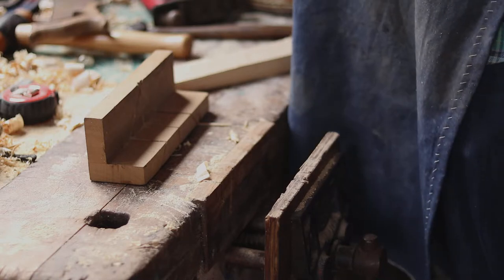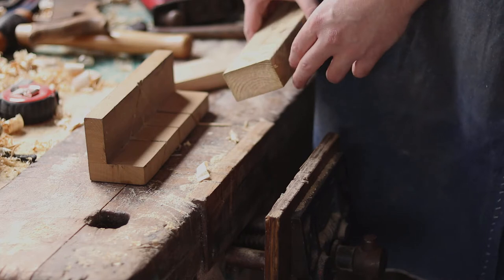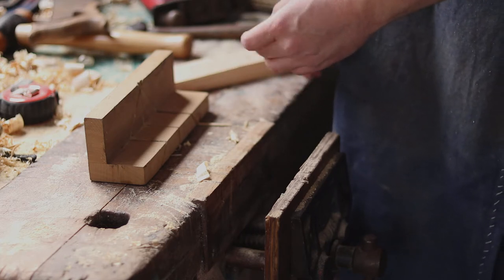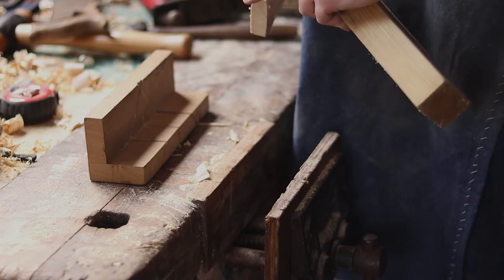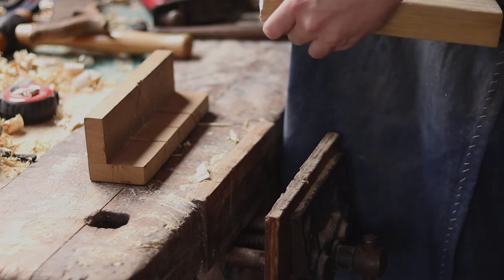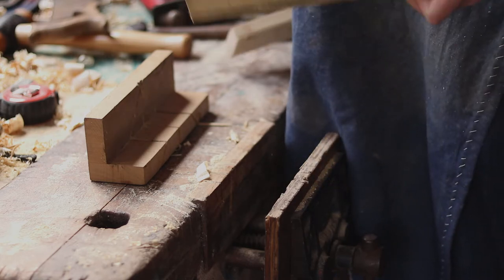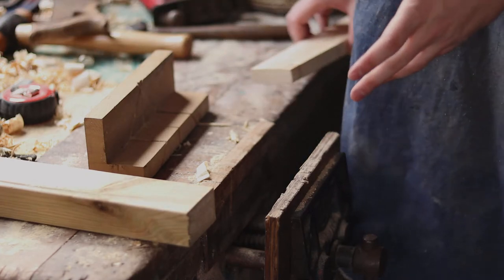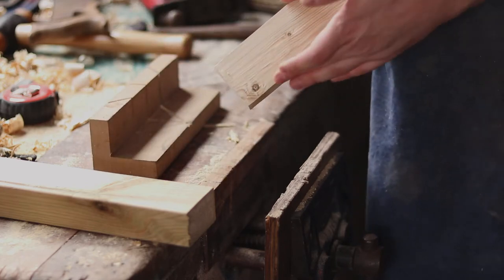So what I'm doing for the top of the stool is actually slightly different to what the plans say. The plans say that I should be taking a quarter, so cutting off essentially a quarter of that to give space for joints around it. I think it's called a half lap, but essentially I chop half of that off and then there's a space for it in there. However, that's quite complicated, and as the saw blade that I was using has broken, all I've got is an old-fashioned manual saw. So what I'm going to do is instead attach everything at 45 degree angles.